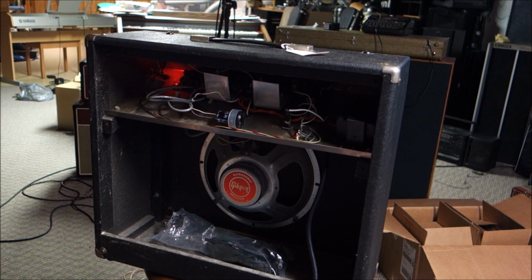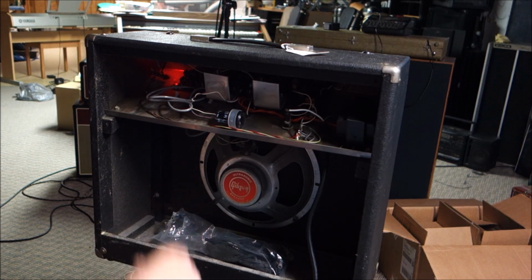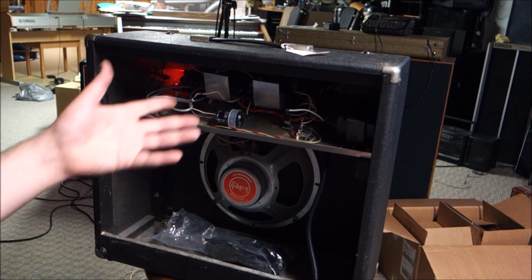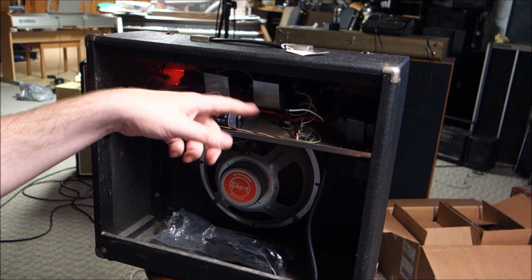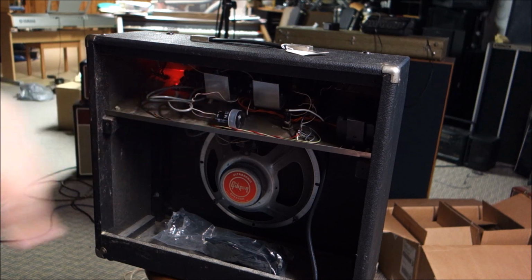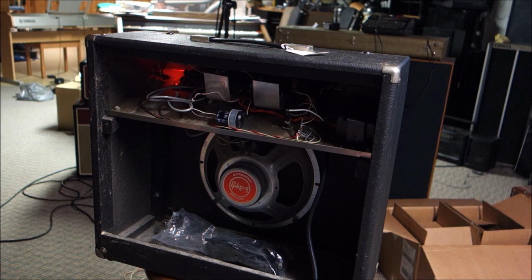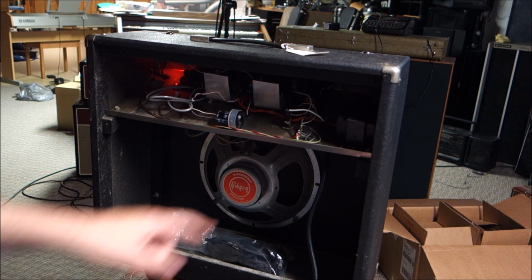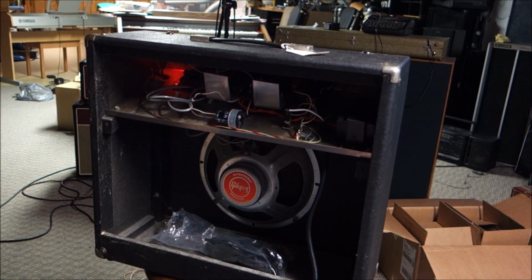So I thought about a lot of the old AA5 radios and two-prong cord things, and the two-prong cord was never polarized. You could just plug it in one way or the other way, and if it made too much noise, you were supposed to flip it. Maybe, perhaps, when they designed this amp, they were intending for the switch to actually run on the neutral rather than on the hot wire. So just working off of that premise, I switched the neutral and the hot coming in from my mains plug. I turned it on and it still hummed, but then taking the ground lug from the green third prong and putting that to the chassis stopped the hum.